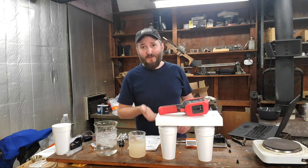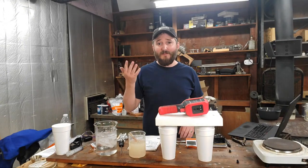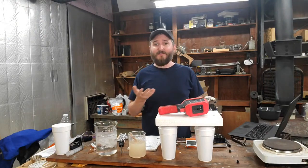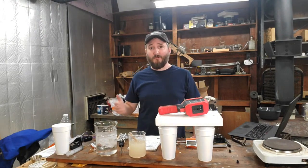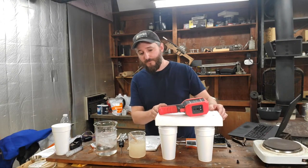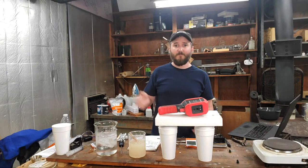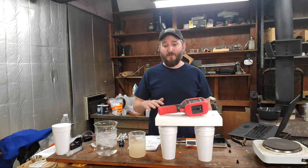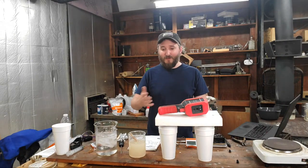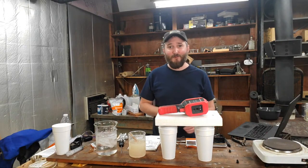The problem with styrofoam as a radiative cooler is it doesn't have a favorably emissive pigment to radiate its heat as infrared light. And it also is very insulating. Because it's insulating, even if the surface is getting much colder, radiating its heat off into space, you're not going to feel that on the underside. It's not going to be very good at giving you BTUs or watts per meter squared amounts of cooling on the underside of the surface because it just doesn't transfer heat. But because it's an ultra white coating, foams like styrofoam could be really interesting to experiment with for cooling purposes.